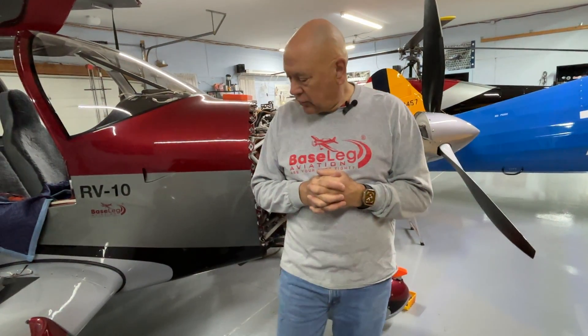With regards to the rest of the airframe, it's a thorough pre-flight just like any other aircraft. Make certain there are no loose objects inside the cabin, unoccupied seatbelts are attached, and as you deflect controls from stop to stop — both fore and aft — they're not going to catch on anything in the cockpit. Nothing comes loose, including clipboards or notes that can slide forward, get jammed between seats, jam up on sticks, or get caught on rudder pedals. Make certain your rudder pedals go to full deflection, and that at full deflection you still have braking. For taller pilots especially, at full rudder deflection you may find no brake pedal because it's hitting the firewall — it might have worked on the bench, but now you've added firewall insulation, hoses, or wiring. Do this in a quiet environment, especially for rudder cables, so you can hear the cable moving and confirm it's not rubbing.